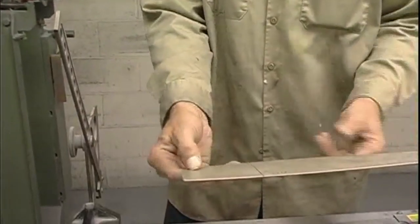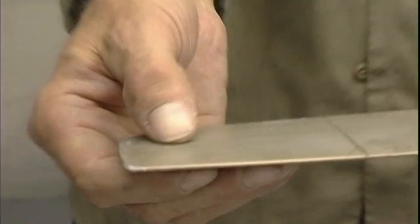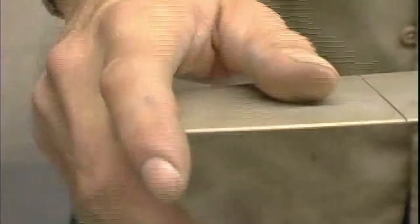It's like taking a piece of copper wire and bending it and bending it, all of a sudden it breaks. When you get a nick in a leading edge or a big gouge or something like that, as that metal hardens, a crack can form and you can have blade tip failure. Which, for someone like yourself that's been flying a while, that wouldn't be fun. So that's why, in overhaul, I take off the whole outer skin. By the book, it's 8/1000ths, like 4 on a side. And that's usually what it winds up being in thickness. That goes for the leading edge too.